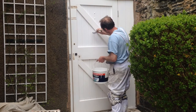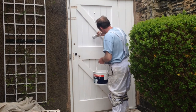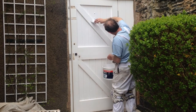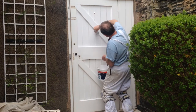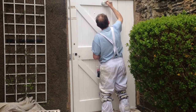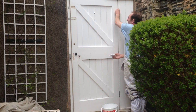It's well worth using the Dulux Weathershield range — undercoat and gloss — especially on outside timber. Depending on how much weather it gets depends on how long it'll last. As you can see, I've done my inserts now, so I'm going to do the flats. Always go with the grain.